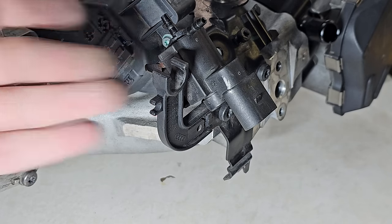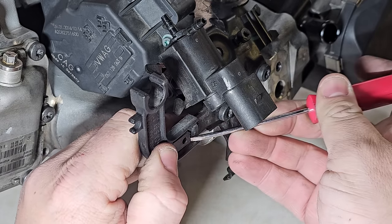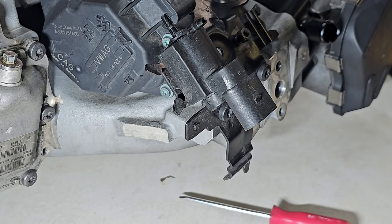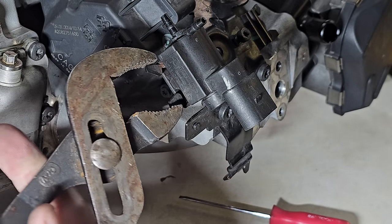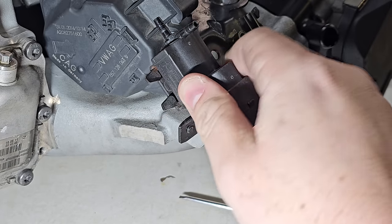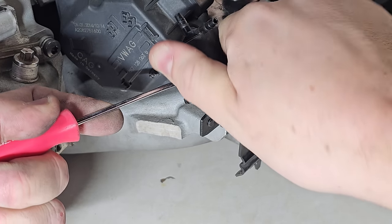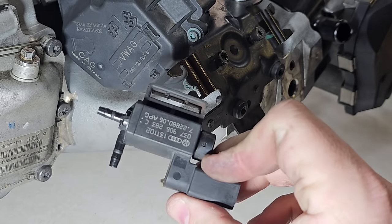To get this solenoid off, we need to slide it off the bracket, but there's a U-shaped piece of plastic securing a line — pop that tab up and it slides off. You can see two pieces of metal stopping it from sliding off directly, so use a pair of pliers or channel locks to compress them. Once those are in, work it off and it comes off. Now we can relocate these to the MRA 1900.